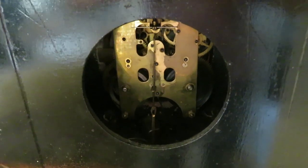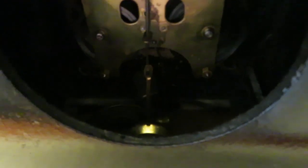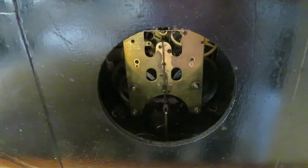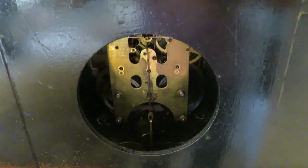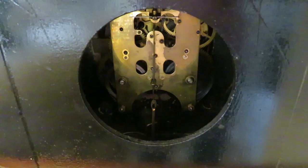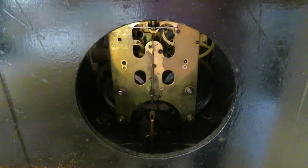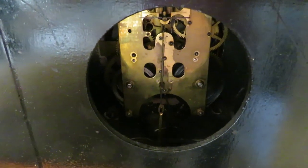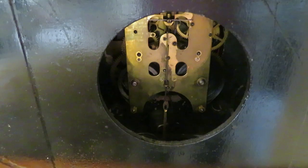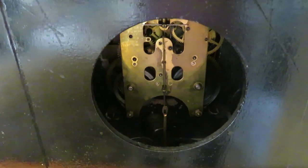The clock ran all through the night without the pendulum, and today I've got it working with the pendulum on - you can see it functioning quite well. The best way to set these clocks up is to have it perfectly level everywhere, front to back and side to side. Let it run without the pendulum for half a day or overnight, then try it with the pendulum. If it doesn't work, pack it up a little at the side. It's perseverance. To regulate it, increase or lower the weight on the pendulum, and there's a little adjustment on the front at the top as well. I'm going to say that's done now.